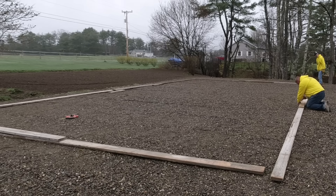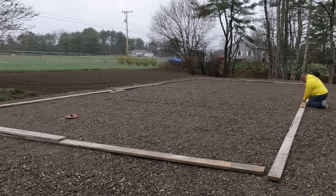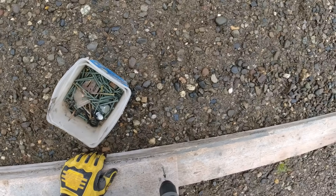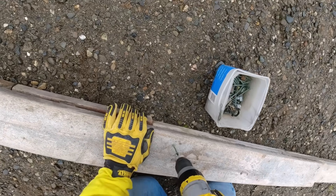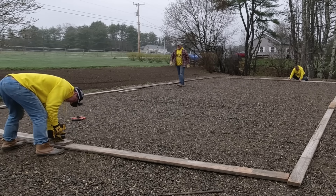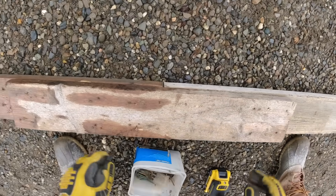The reason we do a lot of slabs on sub-bases just like this here in Maine is we get a lot of freeze-thaw cycles from November to March. If your sub-base is going to hold moisture and then it freezes, there's a really good chance it's going to heave on you. But this type — you can see the gravel mixed in with the crushed rock — this type of sub-base isn't going to heave because it's not going to hold any water. So if you think, why isn't there any footings around the edges or down the middle, a slab design like this doesn't need it. There's not enough weight on it to require those big thick footings.